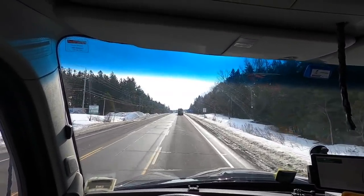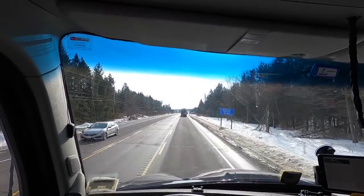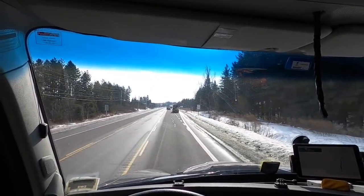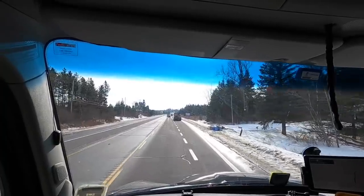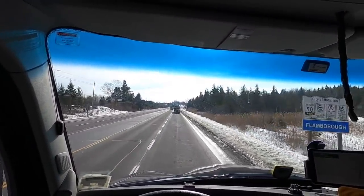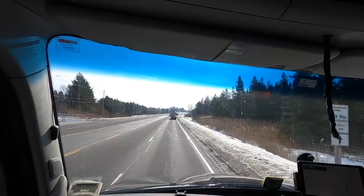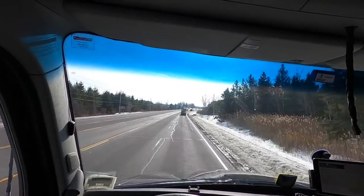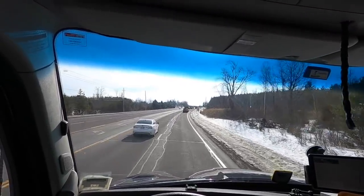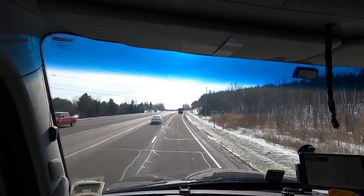That's why I've been changing trailers from a Kaufman 55 ton with 3 axles that couldn't do a lot of weight. I switched to a 55 ton Fontaine with 60 inch spacing. Then I got the neck extension because the truck was getting overloaded. And then I got the flip axle. So now I had an 8 axle rig, which was pretty good. But then I started losing loads with the drop side rail.